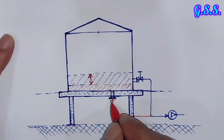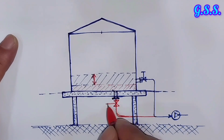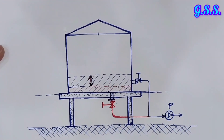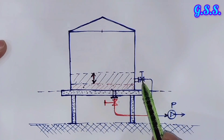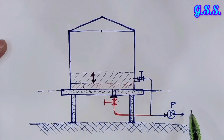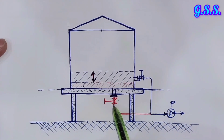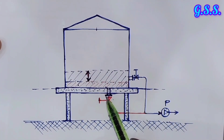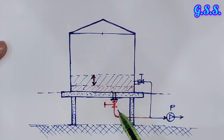This is the first isolation valve after tank outlet. In this case, if there is any leakage through this valve, then nothing can be done and liquid from the storage tank will be lost. In this case also, if anything happens or any leakage is found through this valve, then liquid will be lost from the tank. That's why the concept of quick shutoff valve has come.